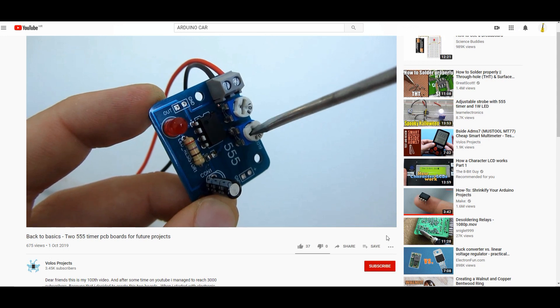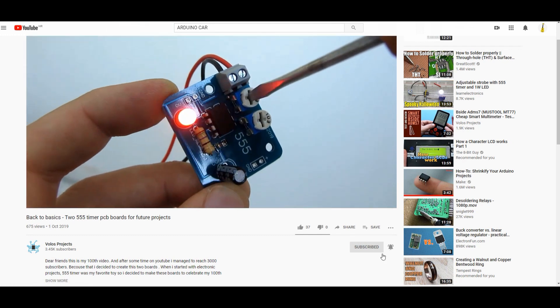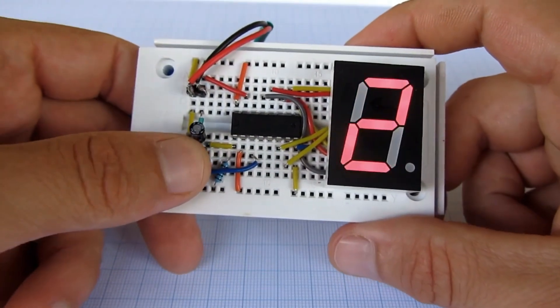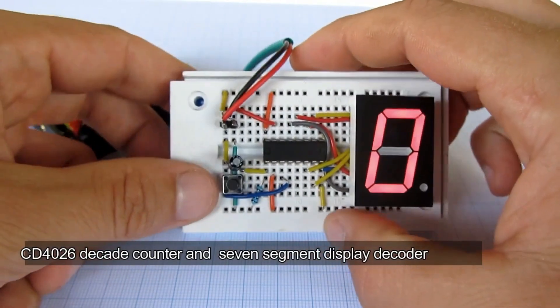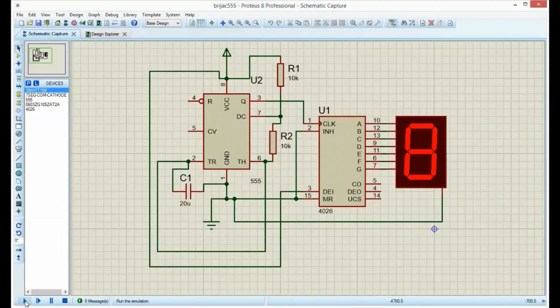If you like this idea, please subscribe and check the notification bell to stay informed. If you want to build this, it is a good idea to make the circuit on a breadboard first. This is a similar circuit but on a breadboard and without a 555 timer, so I press a push button to change the digit on the seven-segment display. Circuit is very simple to connect — you can see that every segment is marked as a letter from A to G. On the IC pinout it's easy to see how to connect each segment. Here I created a Proteus simulation of it — you can use it as a schematic.